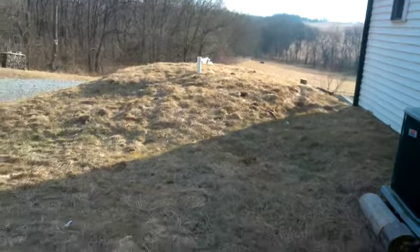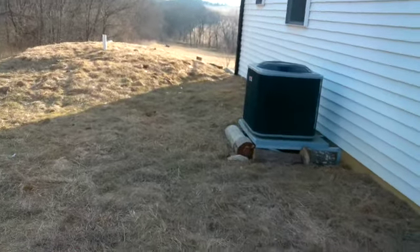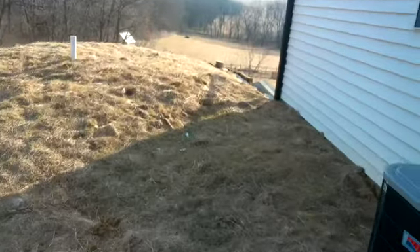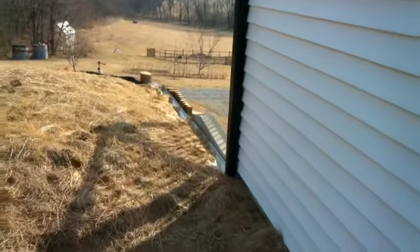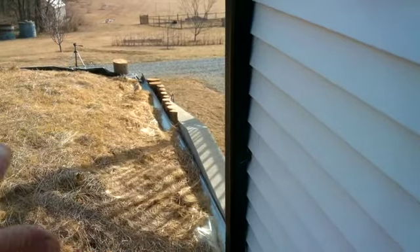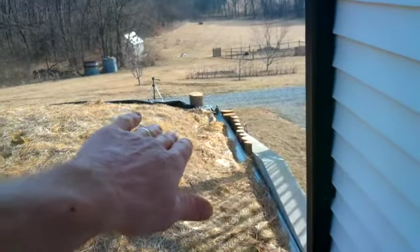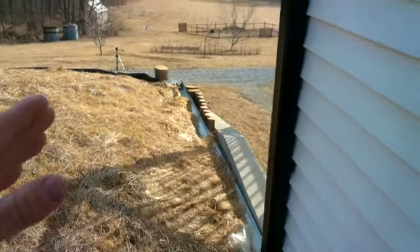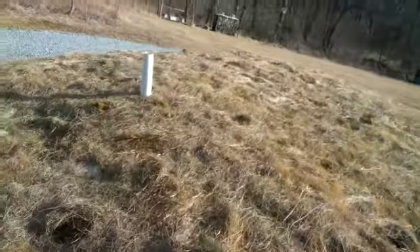Here you can see we've got more or less a flat area, and then you can see the hump there — that is where the root cellar obviously is. I've regraded all of this so the ground slopes away from the house. In this one particular area where the hump of the root cellar slopes toward the retaining wall, I've taken care of that by putting a rain gutter in there, so the pond liner feeds right to that rain gutter. The pond liner goes all the way to that rain gutter, so as water comes off the slope from the center of the root cellar to the south, instead of going down between the root cellar and the retaining wall, it's going to hit that rain gutter and be taken out to the front. The majority of the water is going to flow out that rain gutter.